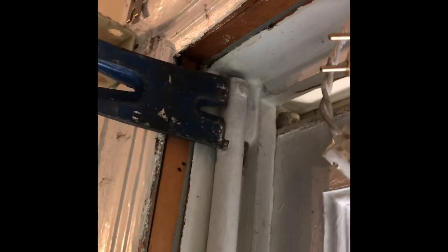I've got my gloves on and my pry bar. I just want to show you this is the spot you want to pry it out from — I'm not going to attempt this with one hand. I'm going to lift the window up to about this point so that these springs don't fly out. You can see now I got one side released and this window is ready to drop — it's a lot lighter. That's basically holding the window from falling, so I'm going to do the other side and remove this sash.